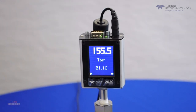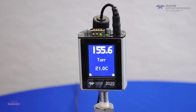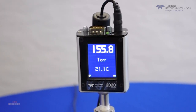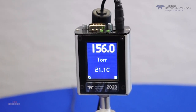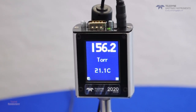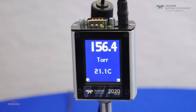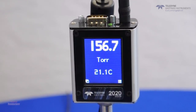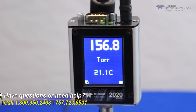Let's say a word about our temperature measurement. On our electronics board, which is outside of the vacuum, there is a small temperature sensor that we use for first-order temperature compensation over the temperature range of the vacuum gauge, which is negative 20 to 70 degrees Celsius. Now, that sensor is not directly in the gas, but it will give an indication of the ambient temperature plus or minus one and a half degrees Celsius. We make it available to the user both on the display and via the digital connection.